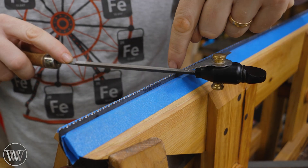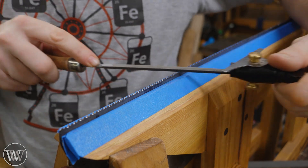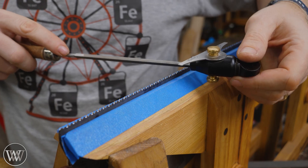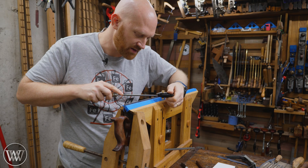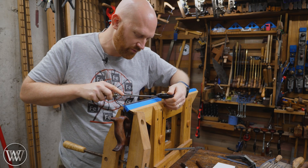All of my pressure is straight down — I'm not pushing onto one tooth or the other, I'm just pushing the file straight down. Unless I need to profile a specific tooth, that straight down pressure is what you're looking for. And now we can kind of zone out and just hit every other tooth.